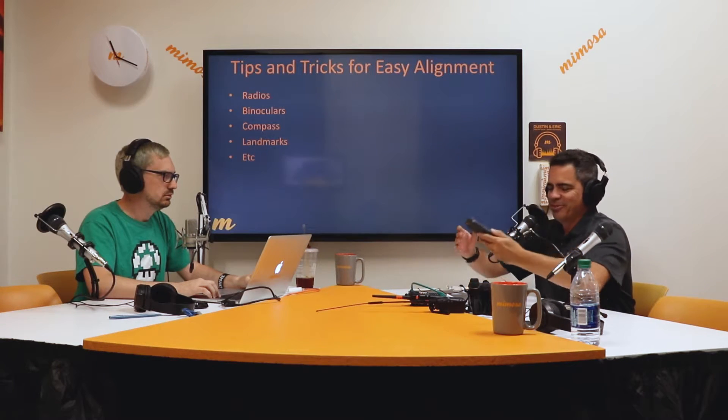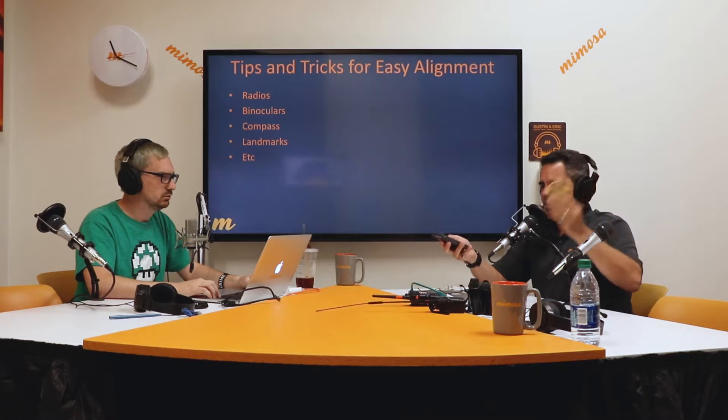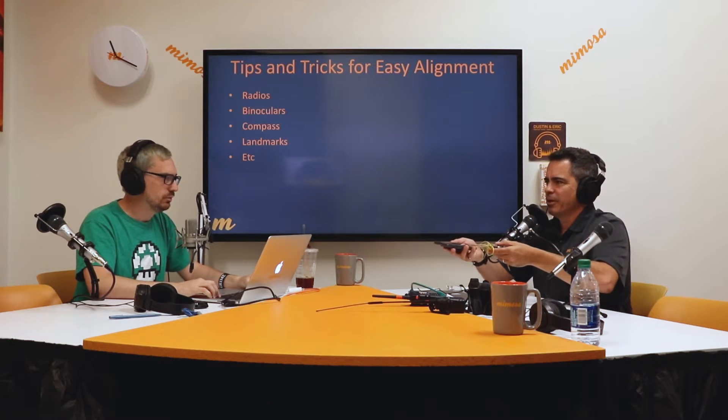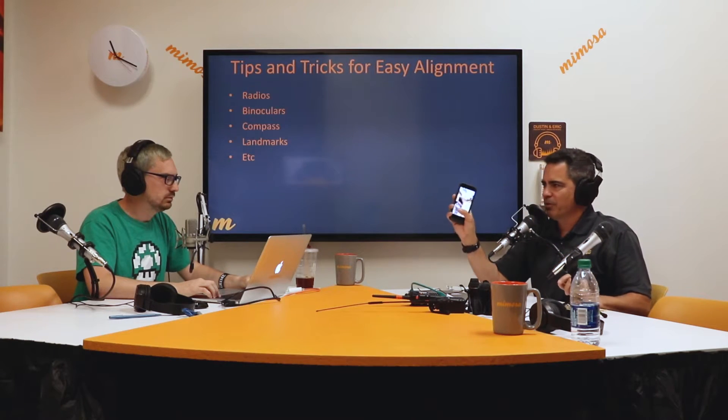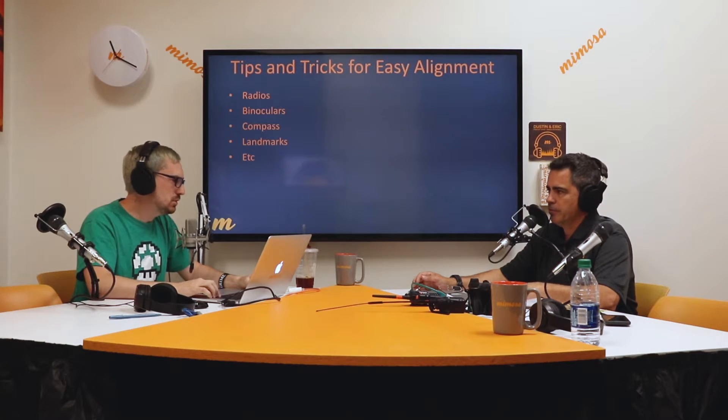You've got to watch out — this physical compass uses Magnetic North, and the smartphone uses Magnetic or True North. What we see on the design tools is True North. If you're using your smartphone and there's no metal obstructions, you might pull out a regular $15 compass and see if they're in the ballpark on Magnetic to compare.